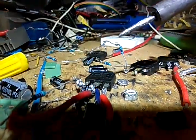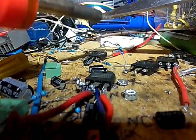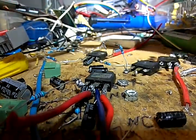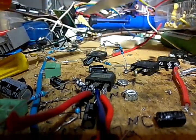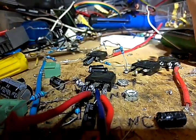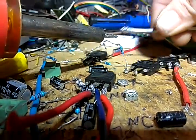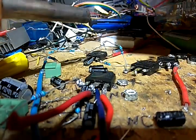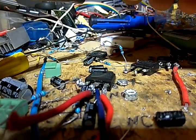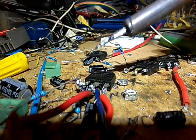Perfect example — see how it's getting a little cloudy? It only takes a second to keep this thing nice and pretty and working good so you don't have to fight your soldering gun for three hours trying to make one little connection. I'm just taking my solder and raking it across the tip. It takes no time — get a little bit of solder on there and I've successfully re-tinned my tip. Now look how shiny that is — see the difference?